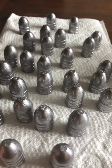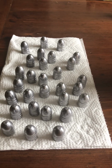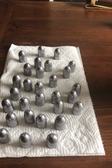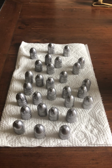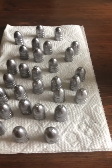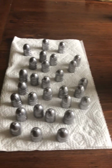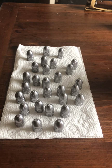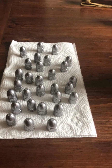When I first started, the solid bullets were becoming popular, and a .590 bullet was the in thing at that time. Now they're going with a .600, and you wouldn't even be able to get a cartridge into the chamber on my Thomas Turner rifle with a .590 bullet in it, let alone a .600. So, more power to you if that works for you, but it just doesn't work for all Sniders. The bores in Sniders tend to vary quite a bit.